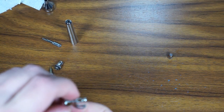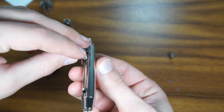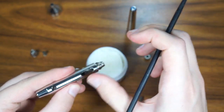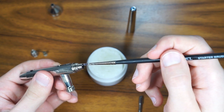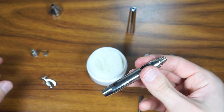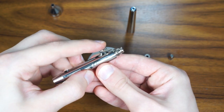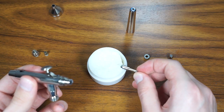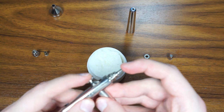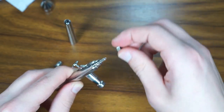After the airbrush is cleaned, it is time to assemble it. So first I install the trigger. There is also one optional step, and that's lubricating the trigger system. For that, I'm using silicone lubricant for CD drives. Later follows the trigger spring and spring tensioner.